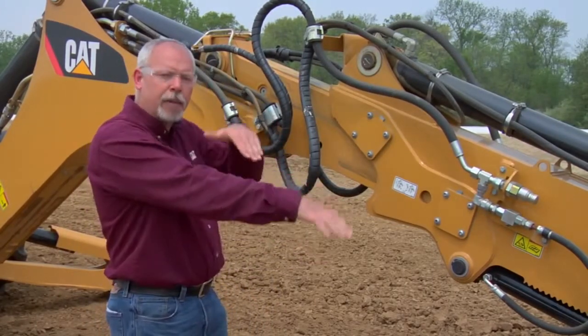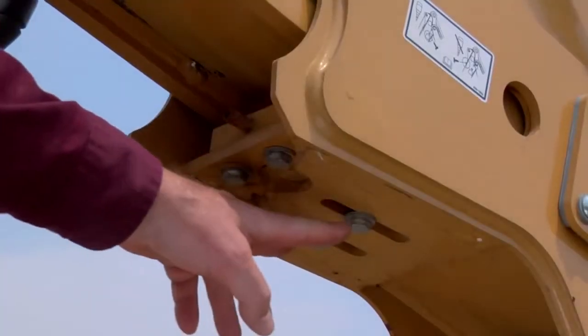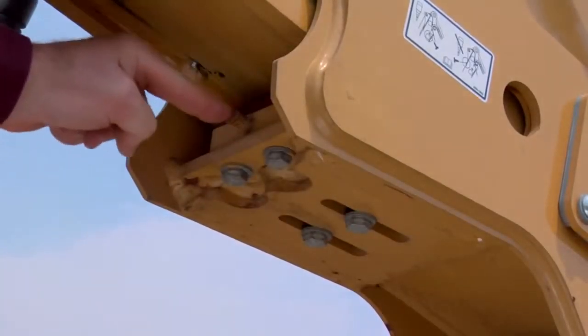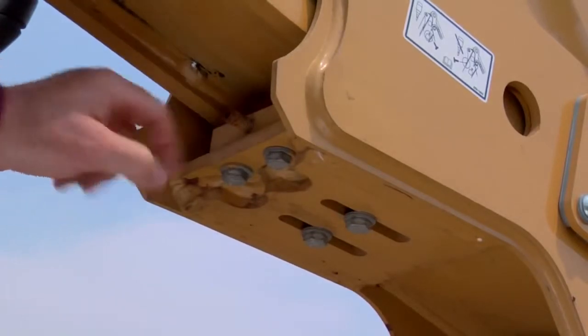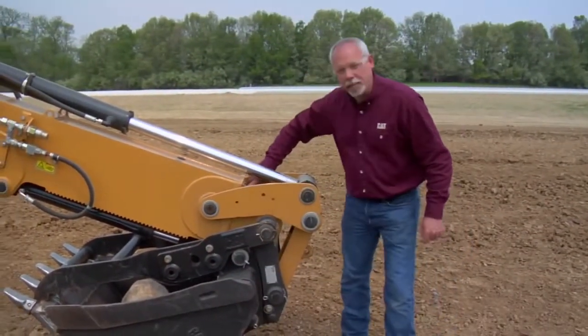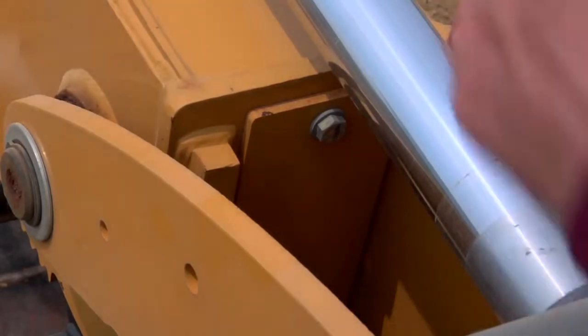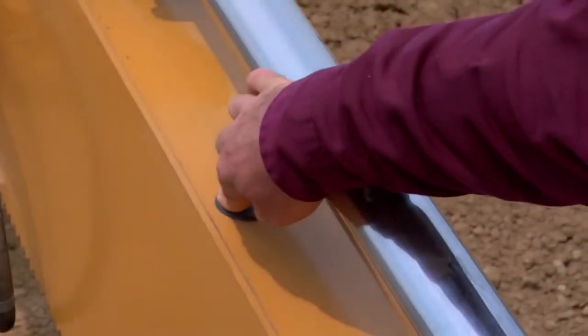We also have a top-to-bottom where it'll wiggle this way. With that, we have a shim down here — it's a wedge block and a couple of pinch bolts that we adjust to take care of one side of that slack. Then we're going to walk right over to the back here, and we have a cover plate back here. You're going to remove this plate, and you're going to have a shim similar to the one on the back side. You remove these two plugs up in here.